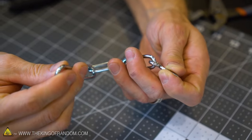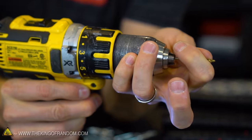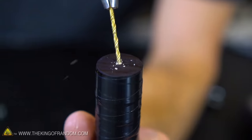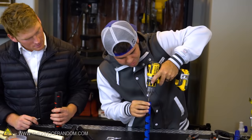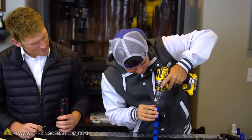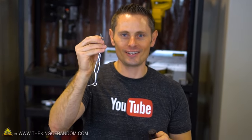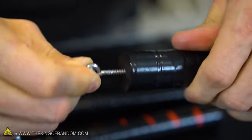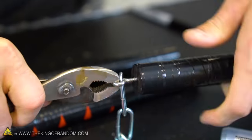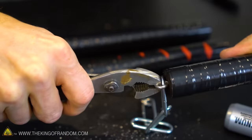Now we just need to do the other side. These eye bolts are number 210 eye bolts, and for them I'm using a 3/32-inch bit. We're just going to use this to drill a pilot hole so it'll make it easier to screw this in without splitting the wood. Try to get as close to the center as you can — it doesn't have to be perfection, just close. We've got our handle made, we've got our drill hole, we've got our chain and screws connected. Now just put the two together and begin to twist. You might need a pair of pliers to help because it's going to start hurting your fingers, but just keep twisting until the head of that eye bolt rests into the wood. And now that's in there nice and solid.